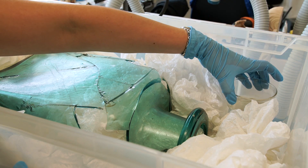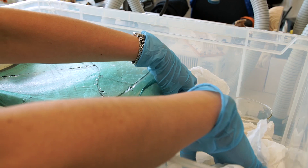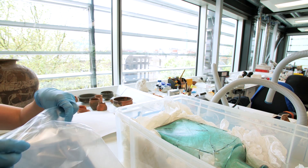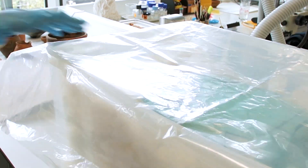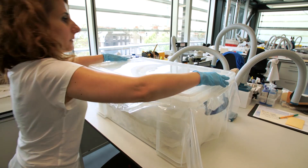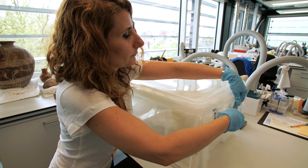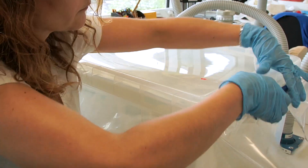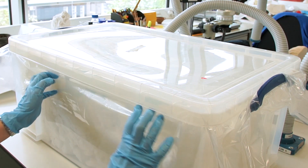I am now placing the acetone in a jar into our environment. Finally, I am putting plastic sheets onto the box to give it a more sealed environment. During the next two days I'll be checking the object to see if the acetone is working and softening the old adhesive and whether the dismantling process is happening.